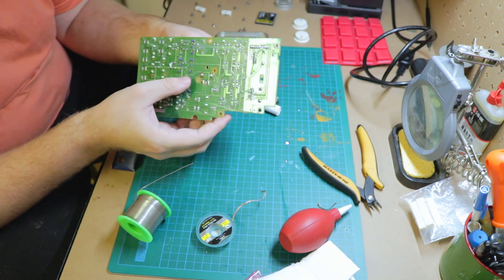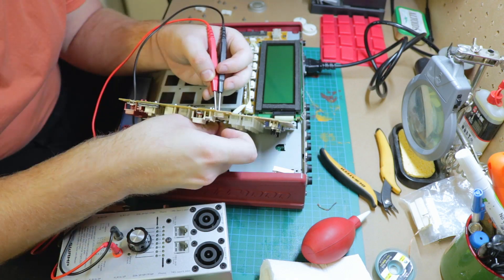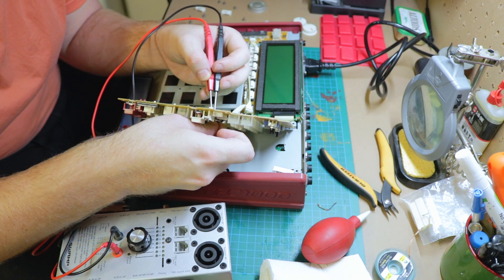Our new part is in — but this is where the video goes a little askew from what I originally planned. I wanted to put the rotary encoder in, put it back together, and show it all working. However, when I put it back together and tested it, it wasn't working at all. After a bit of a freak-out I decided to test what signals were coming out of both the MPC's original encoder and the one I bought, and found out the signals themselves were different — which threw a spanner in the works.